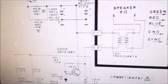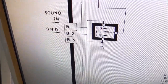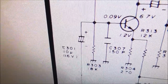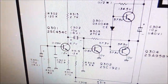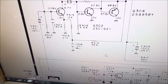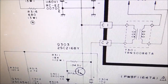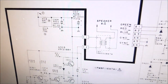Here are the schematics for that area. The sound plugs in here through a simple connector, runs through transistor Q301, and Q302 is just on the other side on the collector. That cap not being attached there would definitely cause issues. It then runs out through the transformer and up into the speaker. So we're going to solder it back on and see what happens.